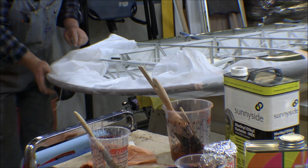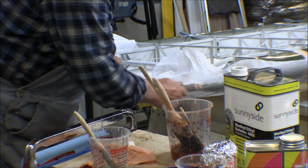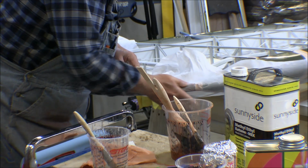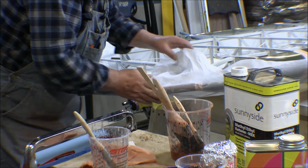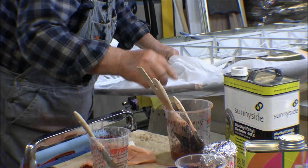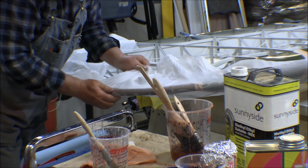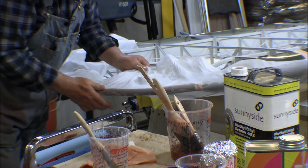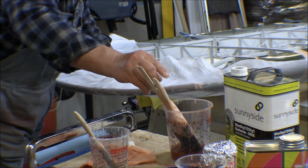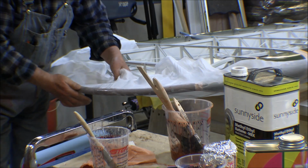All right, there it went. Smooth as a baby's diaper. I put lots of Poly-Tac on there and rubbed it through, but by taking some MEK and some thin Poly-Tac and rubbing here on the outside now, I can loosen up the Poly-Tac inside the fabric and rub it and get the Poly-Tac to come through even more and better and kind of work out some of these wrinkles that I had in here and smooth this out really nice.